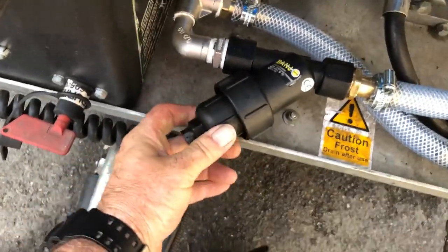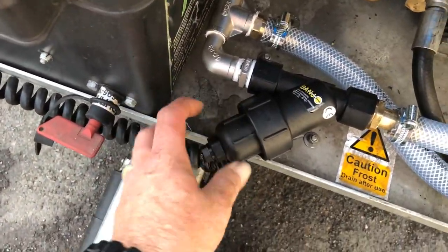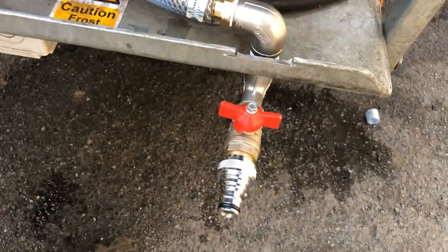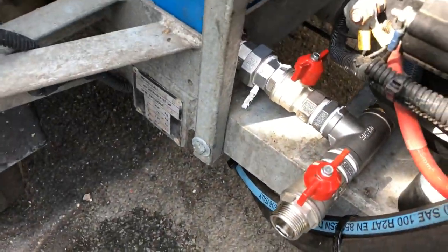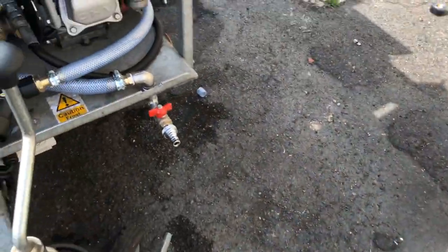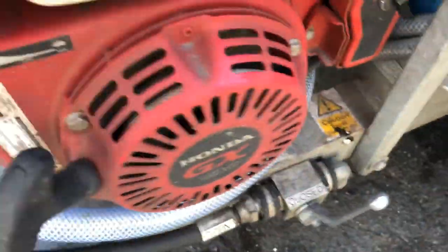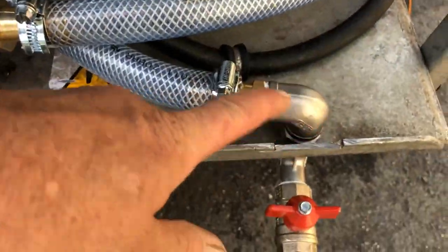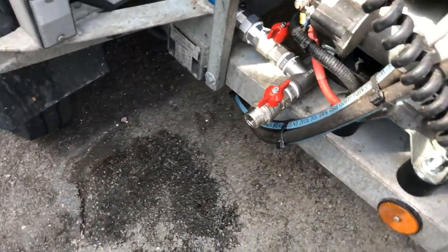This filter — quick and easy access, undo with your fingers. The O-ring is on this part so you're not losing it all the time and causing problems. And your filter's there — one of the best filters in the marketplace, the Banjo Easy. So easy to use. And like I say, we've changed it all to stainless. So when that's closed off at that point — if you wanted to, with that valve closed and that valve open, at the end of the day what you can do is put the mains onto here, make sure your hose is on and that valve is in the closed position, so you can flood all these pipes back out clear. The water will come through, flush this filter back, and flush straight out at that point to make it easy to clear off at the end of the day — using mains water pressure going backwards.